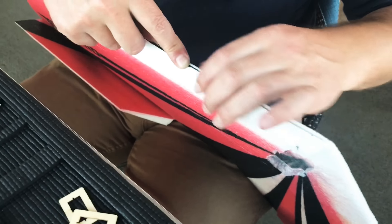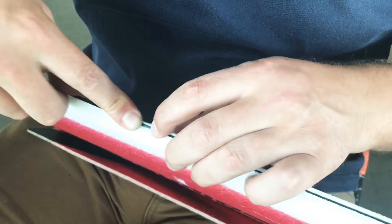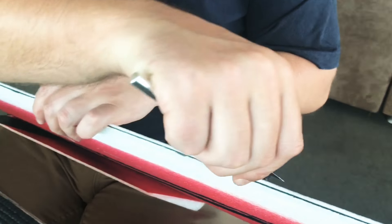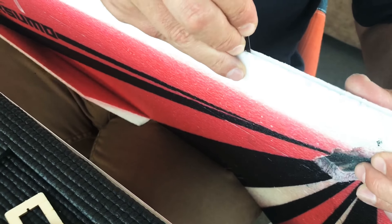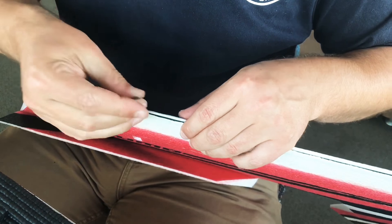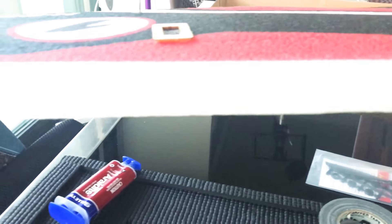I'm just adding the spars in the front - I'm going to top it up for my terrible landings. You basically push that in about half a centimeter. You do a cut probably almost the full length of your blade, all the way along. Then you slide this in - just a 2mm rod, it can even be one and a half if you want - and just push it down as far as she'll go. Then when we put the glue on the top, we close the foam, so the rod will be hidden underneath the foam. You won't even know the rod's there. So we've just put the spars in the front and glued that down - it's a nice clean join.